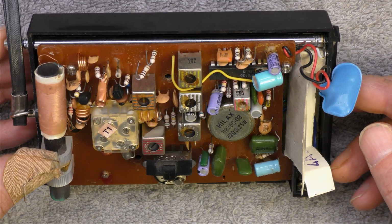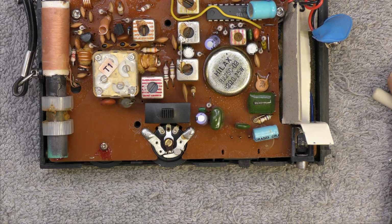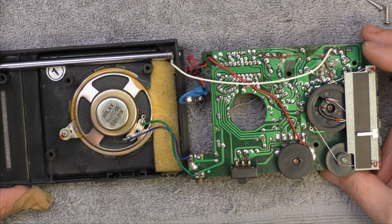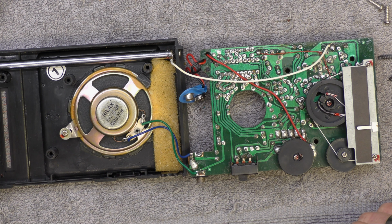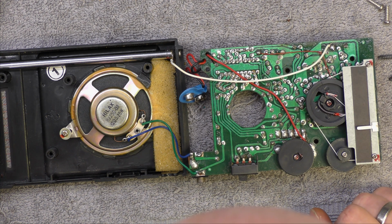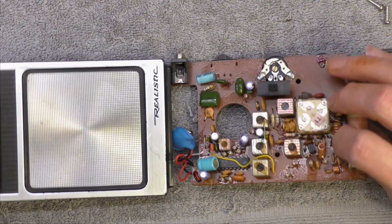Very interesting. Well, I should be able to get the data sheet and then I'll know which pin to poke in order to work out what the local oscillator's doing. Well, here the radio is folded out of its case. There is a dial cord indeed, a very compact one. A small metal tuning scale. I can't see that there's been any mods done to this. Can't see anything underneath, and doesn't seem to be anything on top.